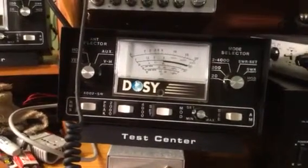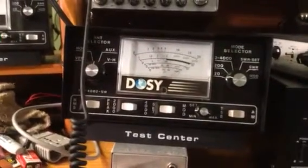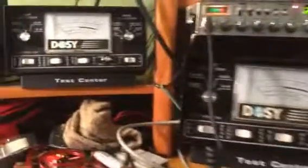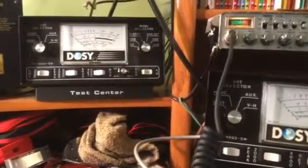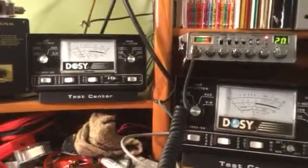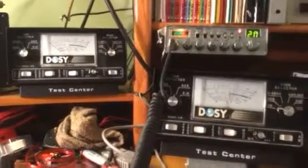The variable power on the amplifier does not adjust any controls on your radio. You put out two watts on the radio — two watts stays going into the amp whether it's turned down or not. The only thing it does is lower the dead key output, and now I've only got about 120 peak watts versus 250 with the variable power turned all the way up.